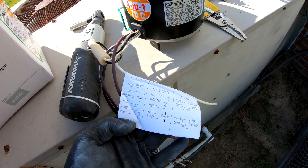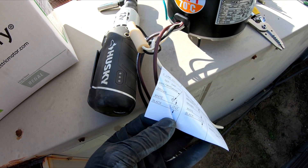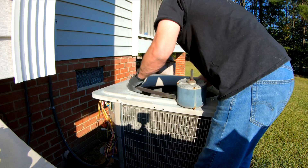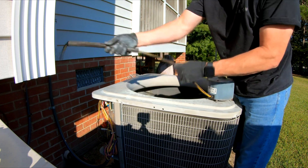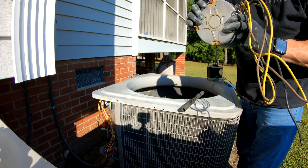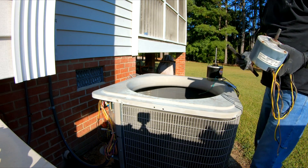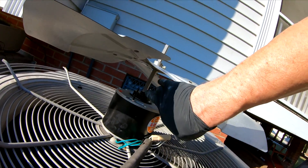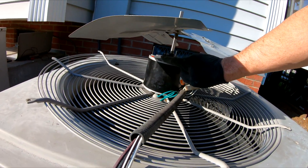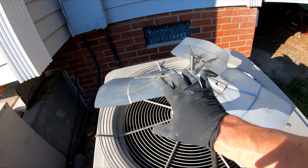Here's a nice little schematic. Brown and white is not used. We're going with brown, white, black on this three-line configuration. Moving it a little further away — didn't even have to cut it, had plenty of room. The shaft's long but plenty of room not to hit anything. Left the studs long. Got my fan blade on, got my conduit on, and the wires pulled through. Just have to fish the wires down and put this on.